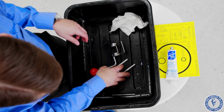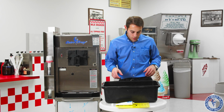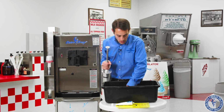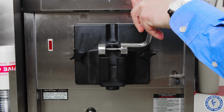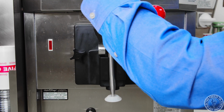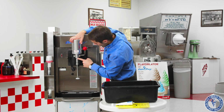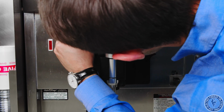We're going to put the rest of our pieces together here. So now we have our spindle motor, which we had off to the side. Our handle sits right into that groove. Our spindle motor, we're going to go right down into here. We're going to push until it sits on that ridge. You can't push it down anymore. Plug our spindle in here.